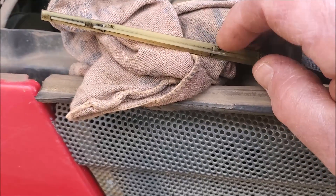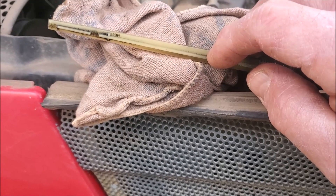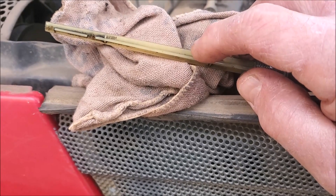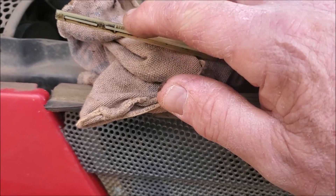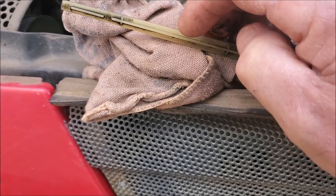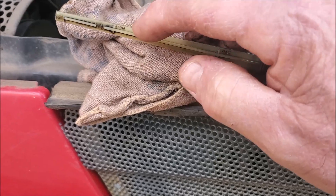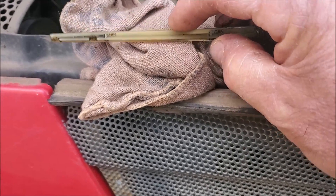These marks are designed for when the engine oil is warm. If it's cold and you pull this out and it's below the minimum line, then definitely you need to add some. But when it's warm, if it's in the middle of this range you're okay. If you start getting down to the minimum line, go ahead and add some oil.